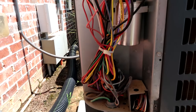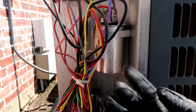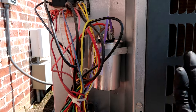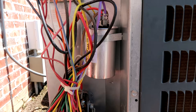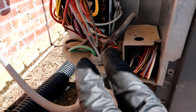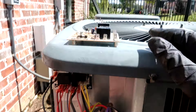This is the old board — see that burn mark right there? That's how I knew it was the board, didn't even have to break out the meter. Plus process of elimination: the capacitor being low on the compressor at 22 microfarads should have meant at least the fan ran since the fan was at 4.6 — close enough to 5. But nothing ran, the contactor was pulled in, and I had 240. Everything else looked good but the board — process of elimination.